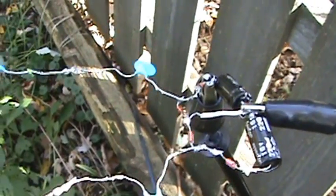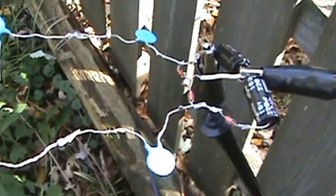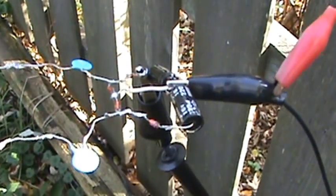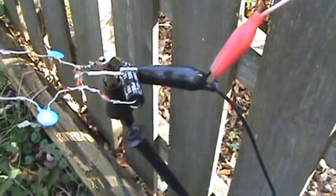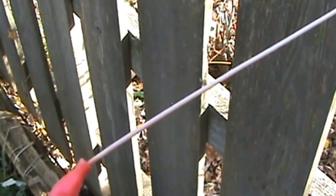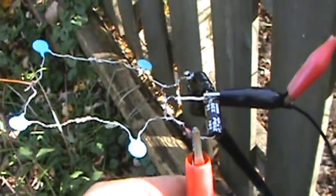He's got a little bit different diodes in there — I'm not sure exactly what type they are. He also has some 16-volt polarized caps at 220 microfarads, and four other capacitors rated at only 630 picofarads — a very strange, very small amount. Let's see how this circuit does.